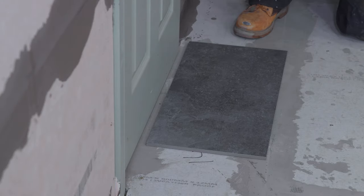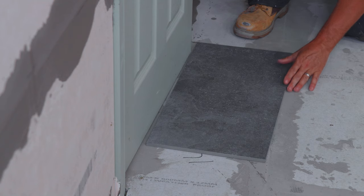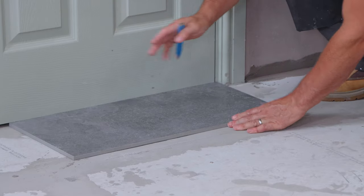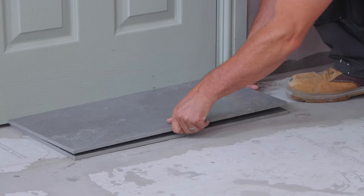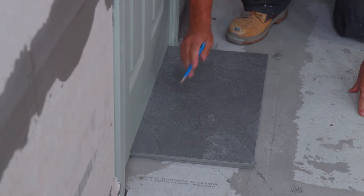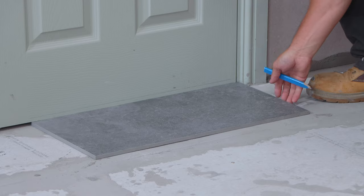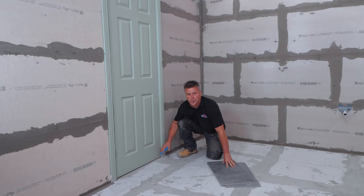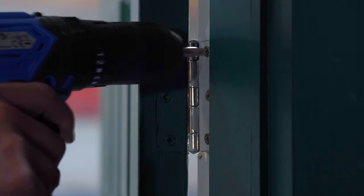When I look under here now I've probably only got about six millimetres, so if I put one tile there straight away I know it's not going to open — and that hasn't even got any tile adhesive below it. So what I would do here is push your door shut, push your tile right up against it — you can see there is no gap. I'm going to get a second tile which is about 10 millimetres thick to allow for your bed of adhesive, then I'm going to take my pencil and draw a line right the way across. Move the tiles and you can see that's probably about 16 or 18 millimetres that has to be cut off the bottom of the door. So open it up, unscrew it off its hinges, either plane it or cut it down and re-hang it, and then it should sail over the top of your newly laid tiles.